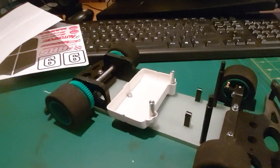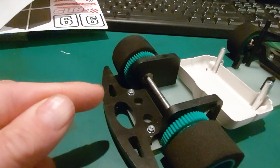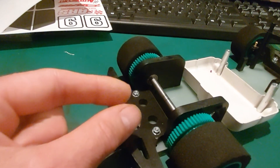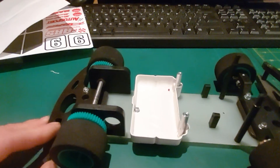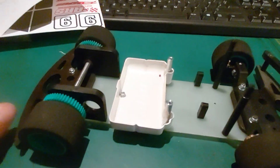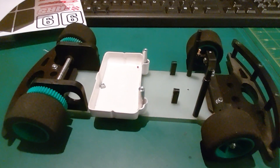The one thing I haven't shown on this one is the rear body mounting. On the other car I built I just used a piece of aluminium angle, drilled a three millimetre hole, bolted on a little brass motherboard mounting spacer, and then cross-drilled the hole for the little body clips. On this I've got developments of those — the later one uses the same sort of servo mounts and they just bolt through. I didn't want loads of holes in this prototype, so I'm developing this into another chassis with variable mounts for the body posts.